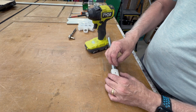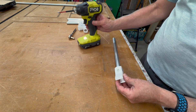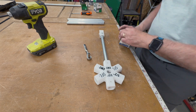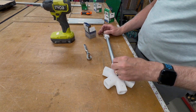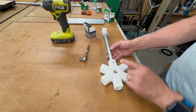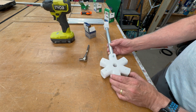With your hole drilled, just thread the M4 screw in. The M4 is really tight in this hole, but just thread it in. You may have to enlarge the hole a little bit, or if you use a manual drill, mark one side, put a little sacrificial screw in there, and then drill the other side. The holes on the other side of the clamps for the center ring are done. Now I get an M4 40mm screw and just repeat the process. Before I lock all these in position, I'm going to drill a hole through the center post — it's a quarter-20 screw or bolt, you'll just need one hole, line it up and do essentially the same thing.